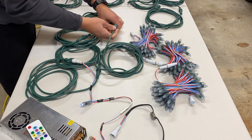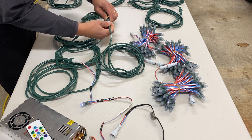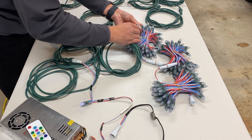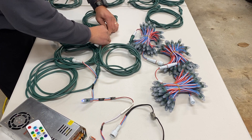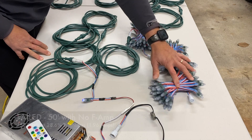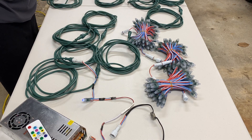So we're adding 10 more feet, going from 40 feet to 50 feet of extension. This is with just the standard 12-volt pixel and no F-amp. Now that we've added that 50-foot extension, we have actually no data whatsoever making it to the 150 pixels. So let's put the F-amp in and see how far we can go.